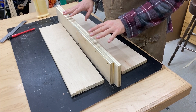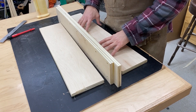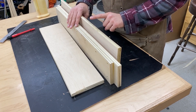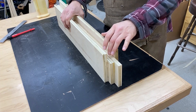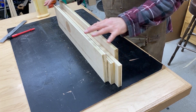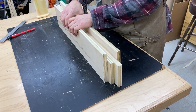The idea here is that we're going to take a four and a half inch piece that's glued up and that's going to be our middle. Now we're going to take our six inch pieces and they're going to be our sides, gluing them up making sure that the rounded edge part is on top. What you're going to end up having is a recess here, and this is where the plywood is going to sit. Everything's kind of uneven on the edges, so I'm going to cut these down to length after everything is glued and dried.